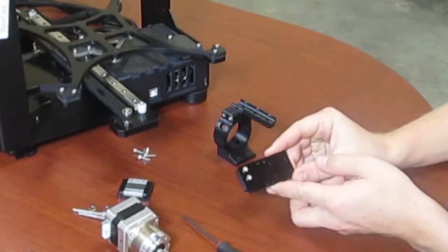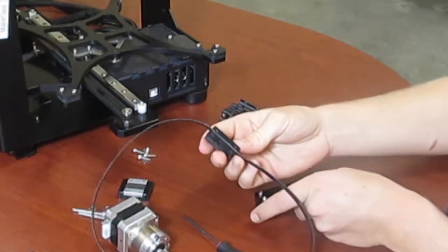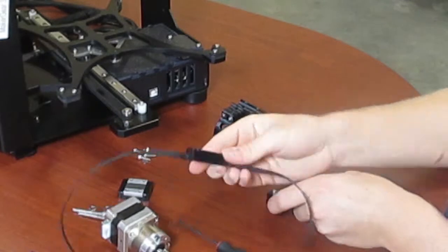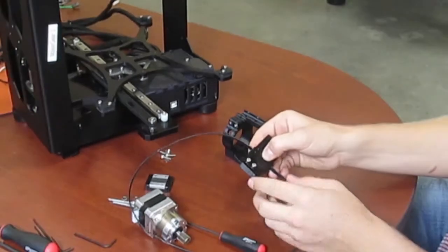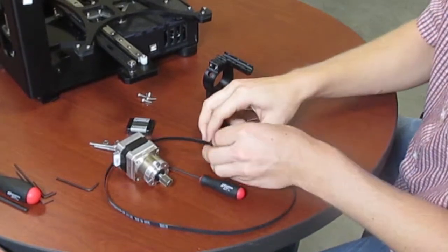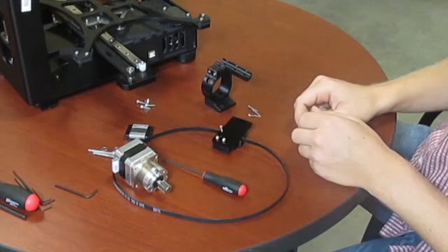After you've mounted your end stop trigger it's time to mount the belt. The belt assembly I have already assembled and I'll leave a link in the description to show how to do so. Place your M2 nuts into the back. Then with the teeth facing out, it will slide under those four holes there. Using an M2 by 16 bolt, slide it through these four holes and tighten it.